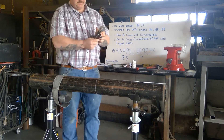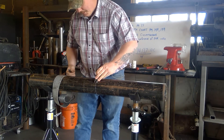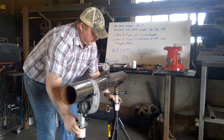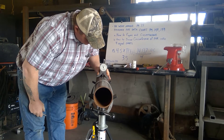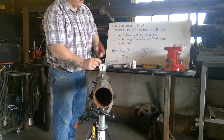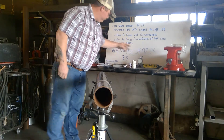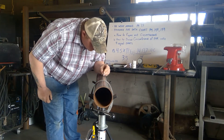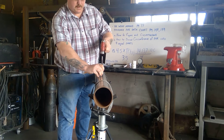To find top dead center, we use an angle finder — set it right on the pipe, find zero, and give yourself a reference mark. This is a nice tool for when the pipe is stationary and you cannot roll it. Once you find it, take your center punch and put a heavier dimple in there — that's point number one.